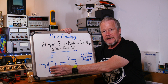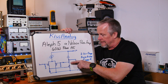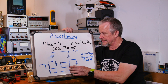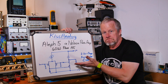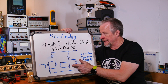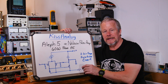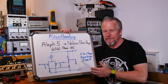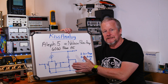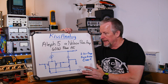It's an input gain stage which is essentially a differential amplifier — you have the input coming in here, feedback hitting this node, and what you get off of them you give to the second stage. The second stage takes that and amplifies it again. The interesting thing about this gain stage is it's single-ended — not push-pull like you find in most amplifiers, even class D amplifiers have push-pull transistors. There are arguments for why single-ended is supposed to be better.